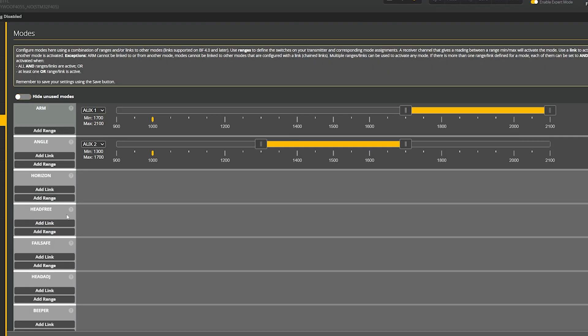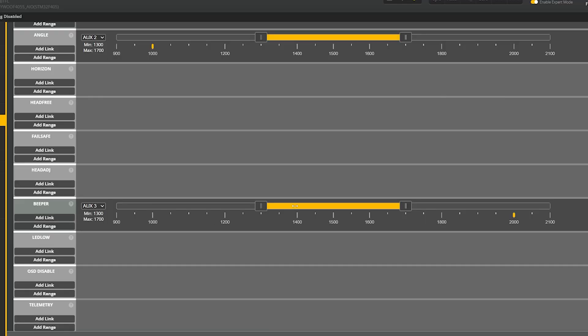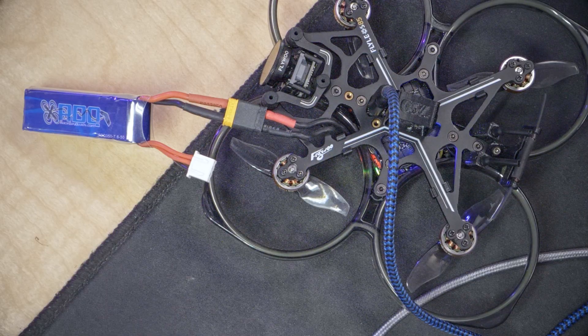In order to take advantage of that motor beeper, I'll go back to the modes tab and add a beeper mode — Add Range. I like that to be this switch here; aux 3 fills in and that's the switch position when it's pressed and released. I'll need to plug in a battery for this to actually work. It's not very loud — oh well, better than nothing.